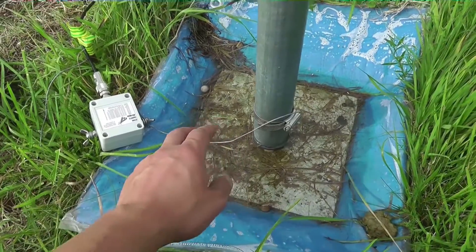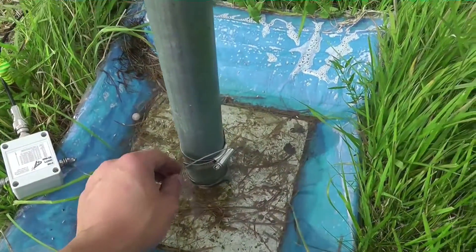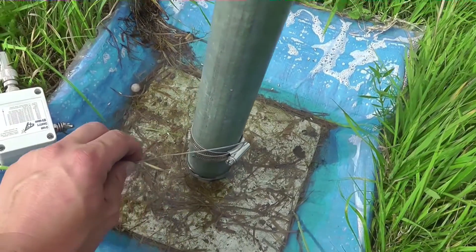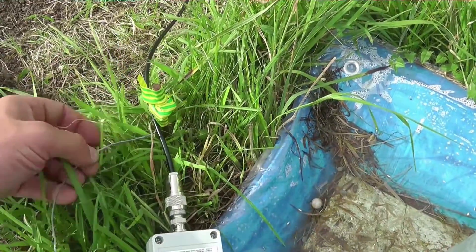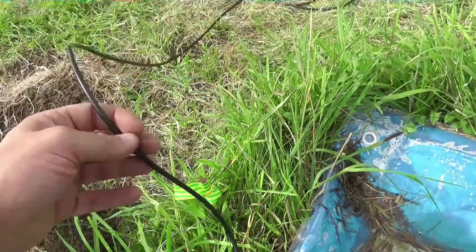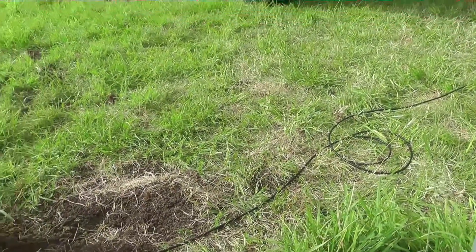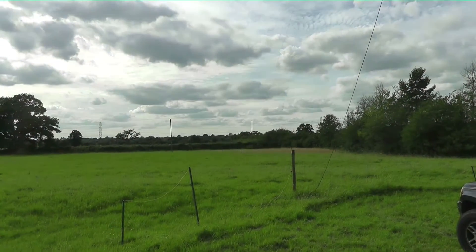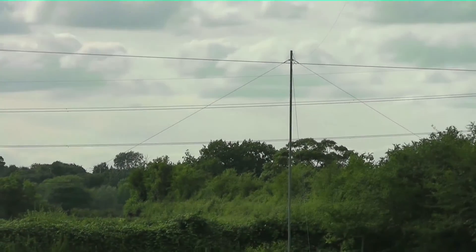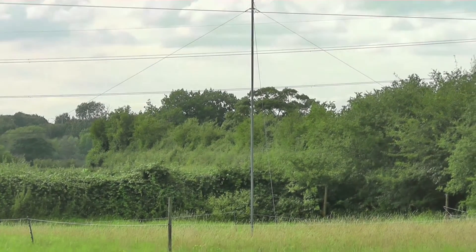Just to show you the other end — same as before, the mast is insulated from the ground by a sheet of tarpaulin. You've got a wire coming off the mast here, so the mast is your driven element into the balun — that's a nine to one balun — and then into my earth rod. Then feed the cable straight up into the caravan there, and that's where I'm going to be running it from. It goes up the mast six meters, and then all the way down to the other mast, 70 meters away.